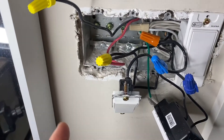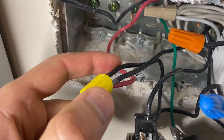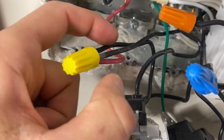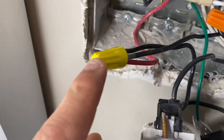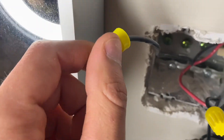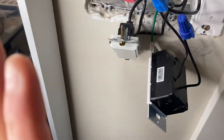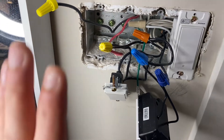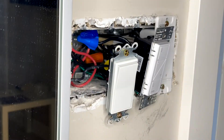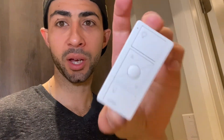Sorry about that — I had to go off camera for a bit because this was getting very frustrating. The switch in the middle was in the way. Since this is a three-way switch, I have to send power to the other side of the kitchen. The red wire is connected to the two black wires where the power's coming from, and the third black wire is just capped off for safety — as per the Lutron instructions. I checked by switching the light back on and everything works.